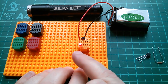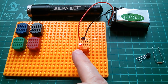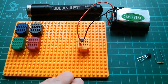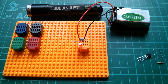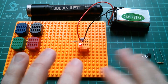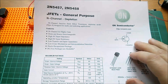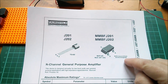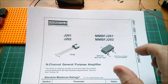Again it's susceptible to electric fields, but due to leakage a negative voltage sitting on that gate pinches off the N-channel; that decays away and the channel conducts. If I turn it around so drain and source are opposite ways round, it does exactly the same thing — a negative voltage got induced onto the gate, and once that drains away it just conducts through that N-channel. The datasheet for the J201 JFET even explicitly states: 'Note: source and drain are interchangeable' — it's a symmetrical device.